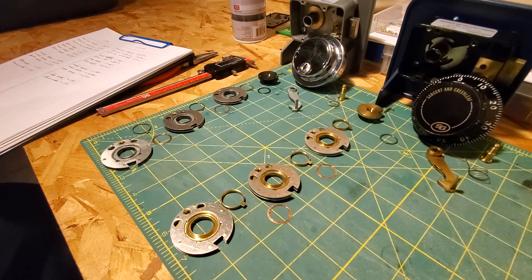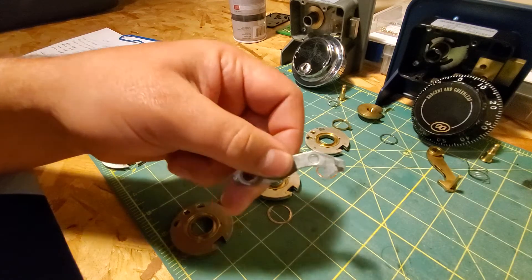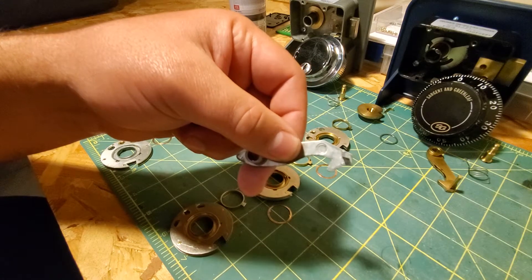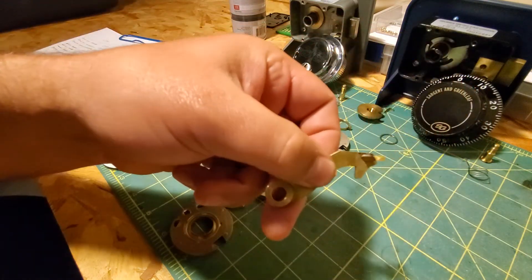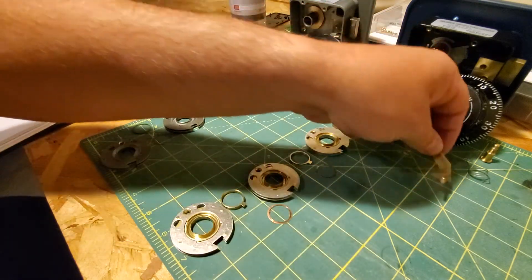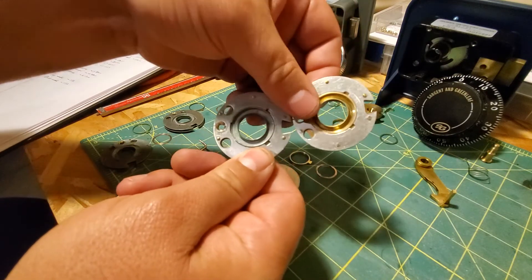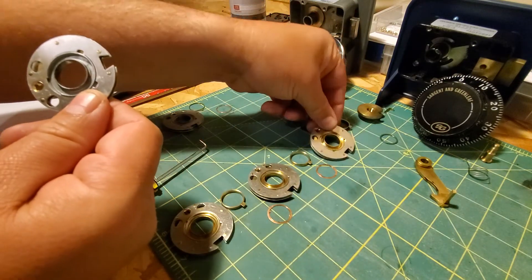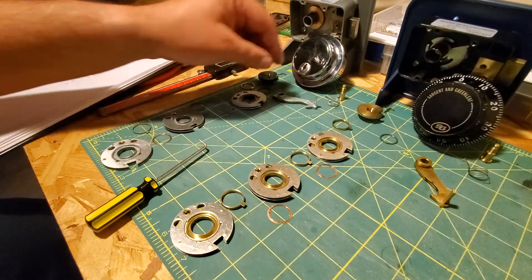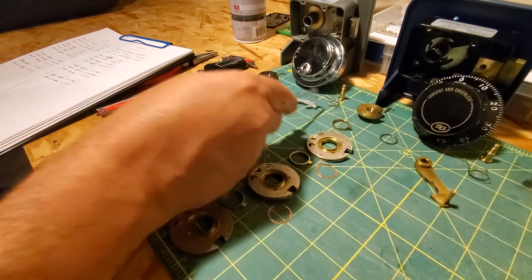One of the things I noticed specifically was the fence. Looking at the fence for the 6741, it's kind of rounded and a lot narrower compared to the 6730, which is a lot thicker — the width is quite a bit more. Interestingly, the gates of both the 6741 and the 6730 measured out to be the same. So right away, one of the biggest differences is that if the gates are the same on the wheels but this fence is narrower, then that means it's going to have looser tolerances.